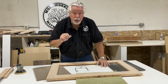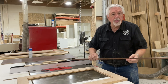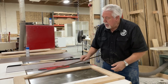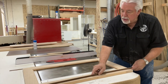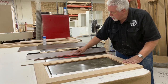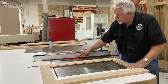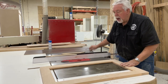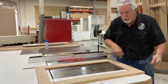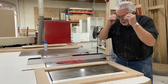We're going to go over to the table saw, cut our groove, and get ready to put in our strip. Our feature strip is just a piece of Peruvian walnut that I milled earlier to a quarter of an inch thick and a half of an inch tall — so quarter by half — and we're going to dado a track into the parts of our frame to line this feature strip up. We set our table saw blade to not quite a half inch deep so it sticks up a little bit, then we'll sand it off. We'll set our saw fence at an inch and go all the way around. We run the top and bottom pieces first and glue those in, then after we sand those down flush we do the side pieces, because I have to dado through one to put the other one in.